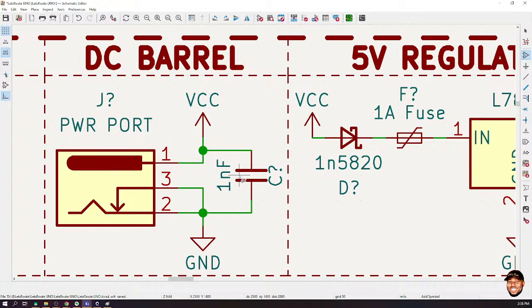Seriously, you don't actually need them. If you do a good job with your board layout, you don't really need them. Personally, I haven't used any ferrite beads in any work that I've done before. Right now, we are trusting that our system's source is somewhat clean, clean DC, and we don't have to worry about many things from there. Is that okay? All right.